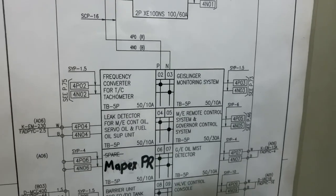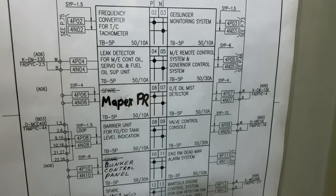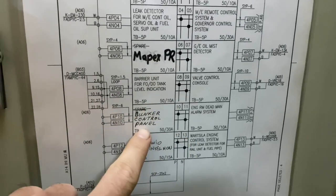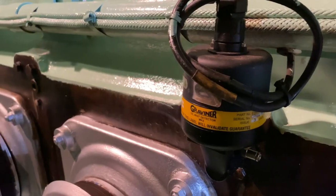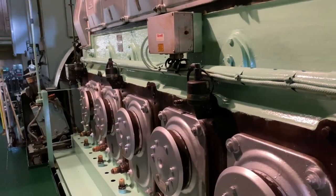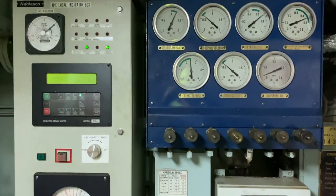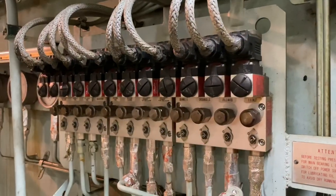I concentrated on the K4D panel — which breakers can be switched off and which cannot — and focused on those which may be prone to moisture or contamination. I had experienced before when we dropped off the GE oil mist detector panel and the ship went into blackout. So I decided to do a visual check on each and every system connected to the 24-volt system.